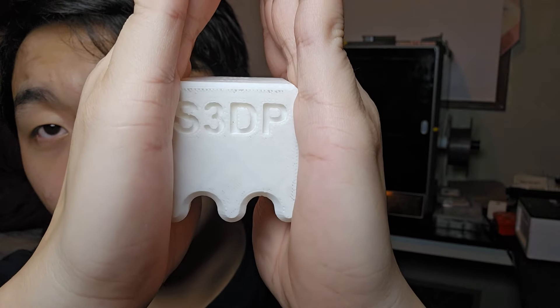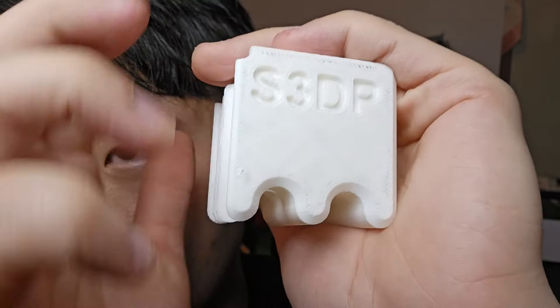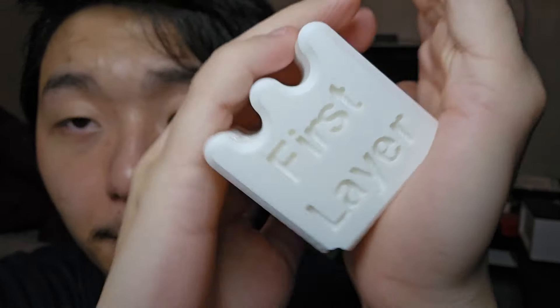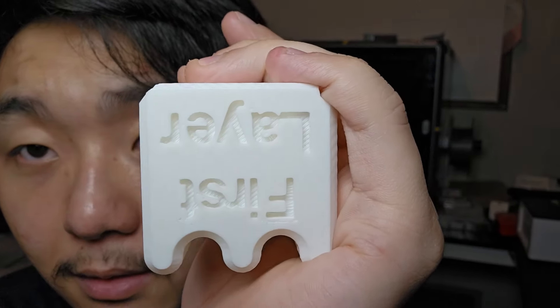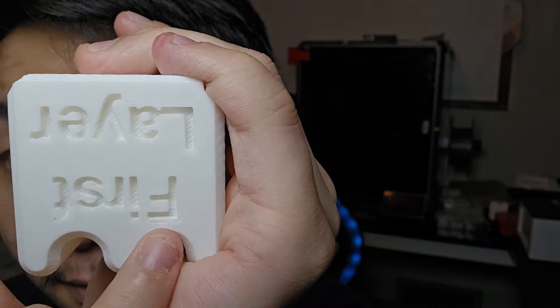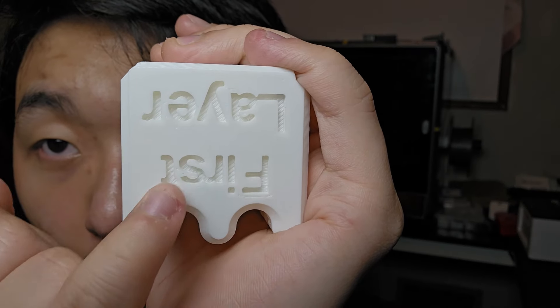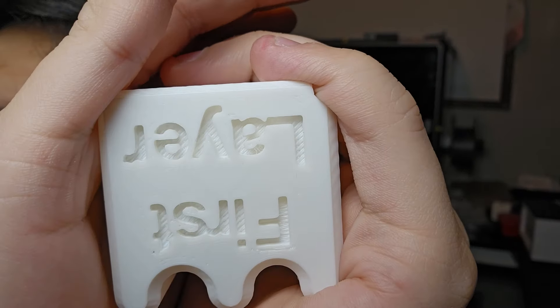The top layer is not that good because I didn't use much infill, so it was printing overhanging and just got defects. You might say the first layer looks really good — and yeah, it does look good — but if you look closely, on the letter F there's a gap, there's a gap all over the T, and if you look very closely there are teeny tiny gaps all over the letters.